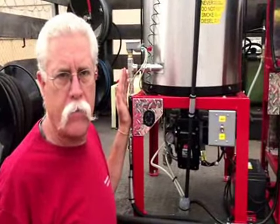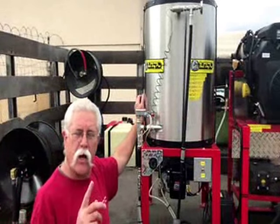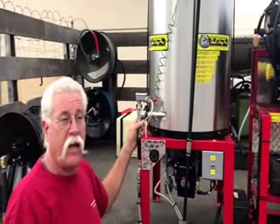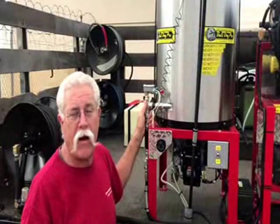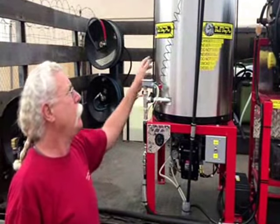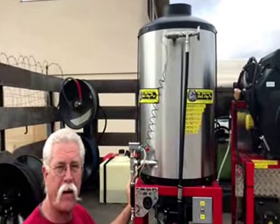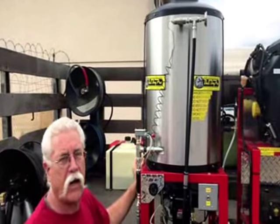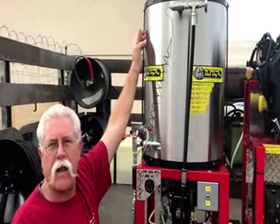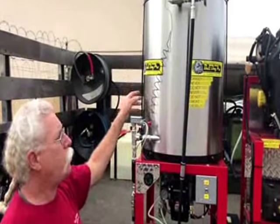I don't want you to have that downtime at all. On these heaters, one of the special efforts we put in is earthquake brackets. Most heaters only have sheet metal screws holding the coil tank assembly down to the base. If you got in an accident or if the screws vibrated out from bouncing down the road on your trailer, we don't want it to fall over on the freeway. We put earthquake brackets on these — there's one on each side, held from the very top right down to the frame with grade 8 hardware. We're not cutting corners on anything. The bolts that go through the top use no nylock nuts because they're going to get hot and melt nylon. We're double-nutting stainless steel. These screws are stainless steel and oversized. This thing isn't going anywhere.